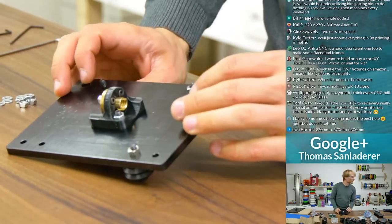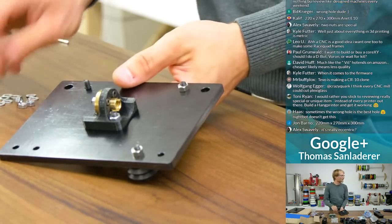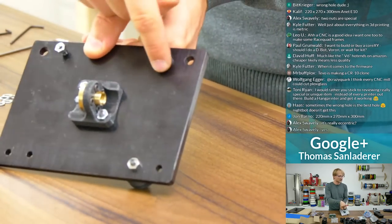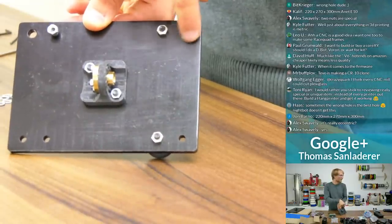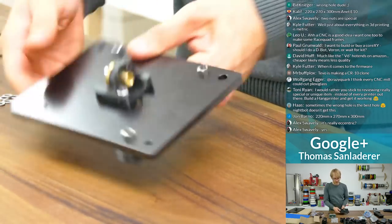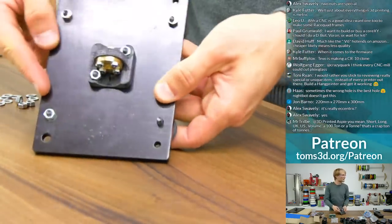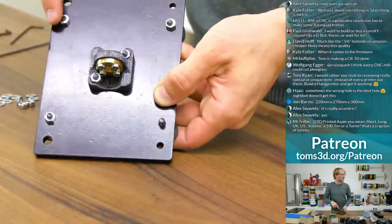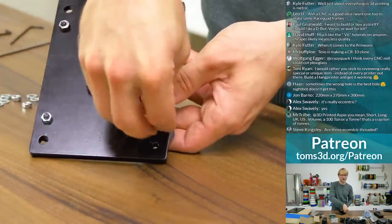So, do we use a washer on the back? We do not. Okay, so straight nuts right there. Is it really eccentric? Well, these are. As you turn these, they allow you to move the wheel. This hole is a bit larger than what the M5 needs, so it allows you to move the wheel around in this hole, within constraints. That's how you adjust these rails. It's the same with any open build system. You have two on one side that are solid, locked in place. And on the opposite side, you can rotate these nuts and basically move the wheel further away or closer to the track.